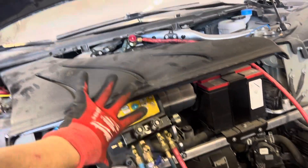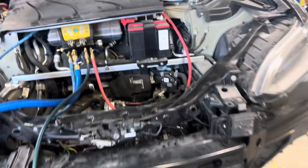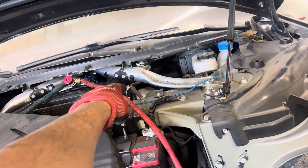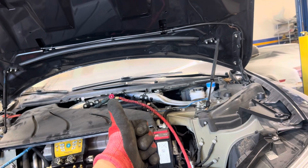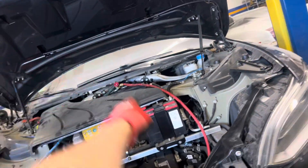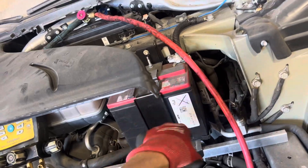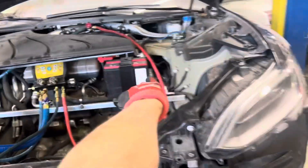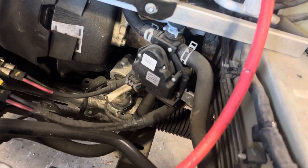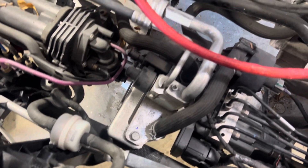Here's your 12-volt battery, and on some of the newer ones these are 16-volt batteries. They're lithium-ion or lithium iron phosphate — I'm not sure exactly which chemistry the 16-volt batteries use. Here's your diverting valve — it's a four-way valve with four ports to determine which direction to send hot coolant and divert cool coolant back to go into the plate heat exchanger. And there's another water pump right there for the coolant.